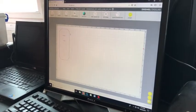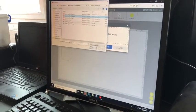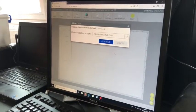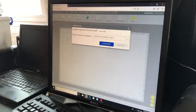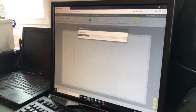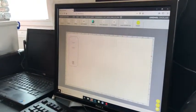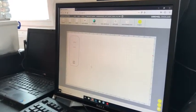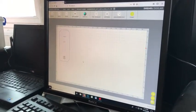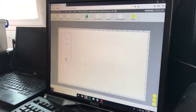After that, I'm going to bring in the etching file. I'll do the same thing — Import — click on our etching file, open it, and this time select 'Import Engrave Only.' This tells the printer that this portion of the file is pixels and it should etch, as opposed to the path that it wants to cut. The software is going to line up our etching file right where we want it on the cutting file, which is a pretty snazzy little feature. That's how you import files into your workspace and let the laser know which parts are going to cut and which parts are going to etch. You can run this job together, but now it knows which layers are which.